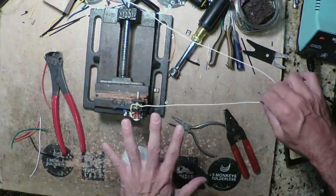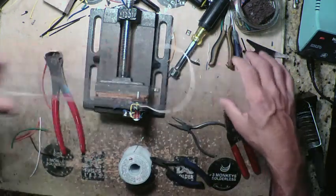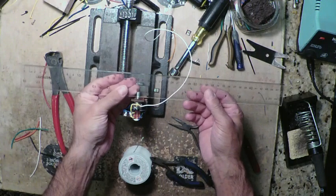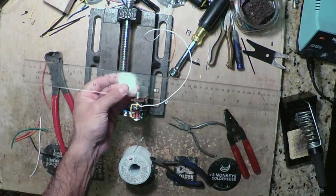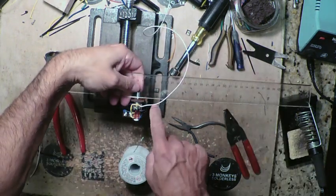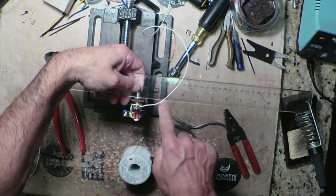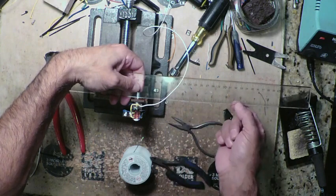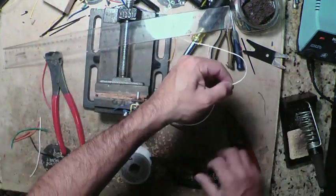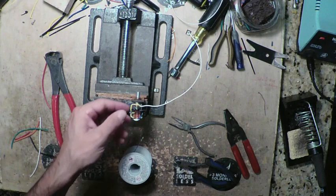So we figure, grab a ruler, how far it's gotta go over the treble control, right? So just to give us an idea, right? So the spacing on the amplifier between the potentiometers should be 1 1/4 inches, 1.5 inches. So it'll be a master, bass, middle, treble. So we'll bring it out just so we have a little extra to play with, about that long. That should give us plenty to get to where we need to go.